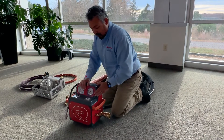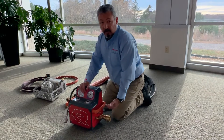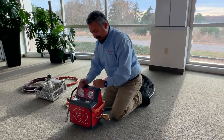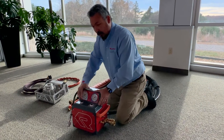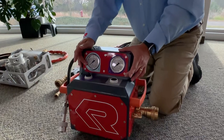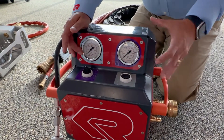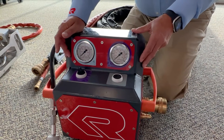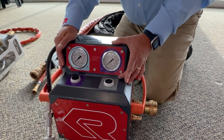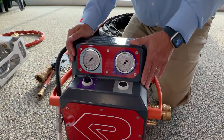It's very simple and straightforward to connect. A department may want to use color-coded electrical tape to make it easier. There are two different gauges on the unit: one shows the air pressure in the bottle, and the other shows the air pressure in the working system. You need at least 600 PSI of air to make the system fire, and it operates off 4500 PSI bottles.